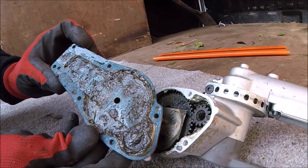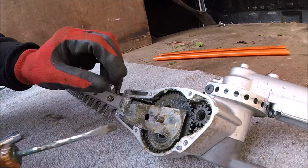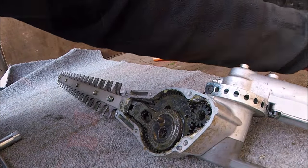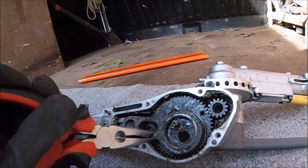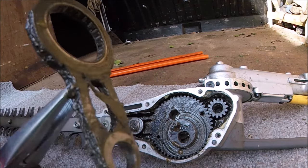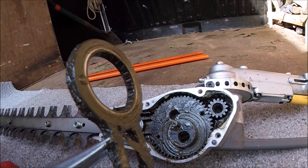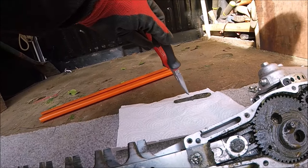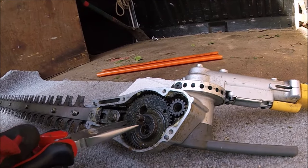As you can see, there's a lot of moisture in there as well, condensation, etc. So very carefully take it apart, and as you take it apart, lay them out in order that they came out in - it will help you later. I'm taking the drive rod off; as you can see there's bearings in that. Not all hedge cutters are going to be exactly the same, but they will be very similar as they run basically by the same principle. Just be careful with your bearings when you take them apart.